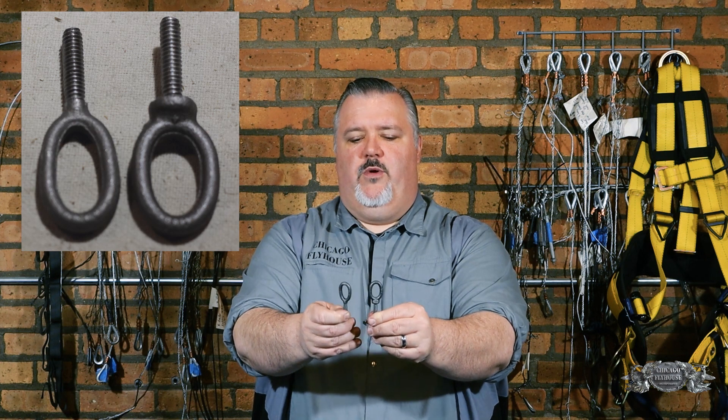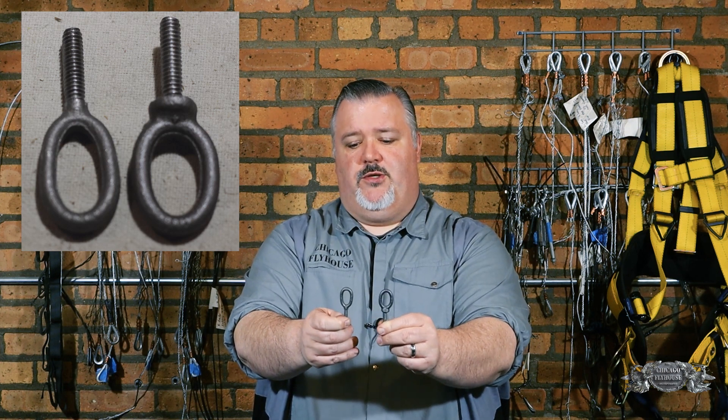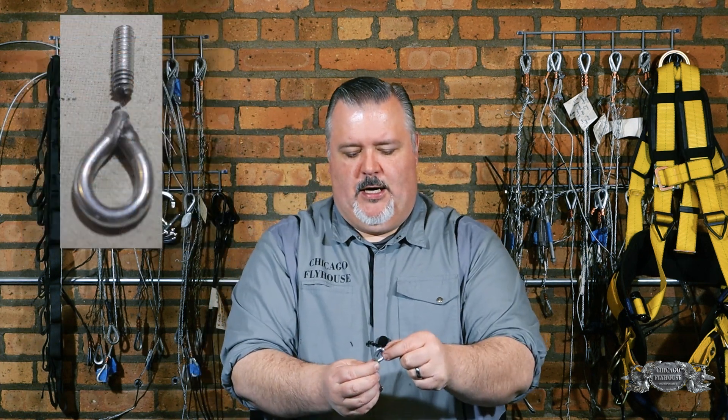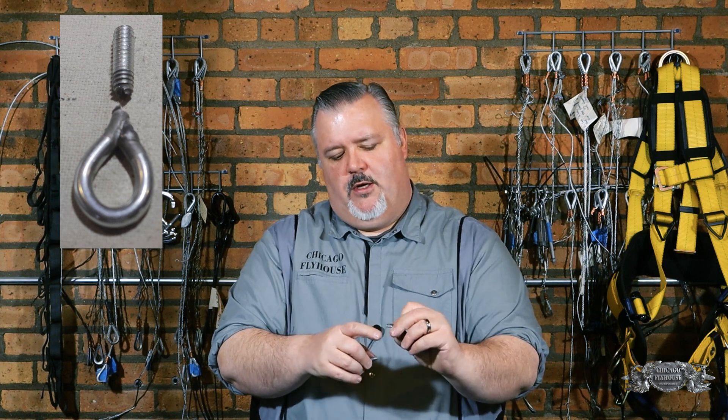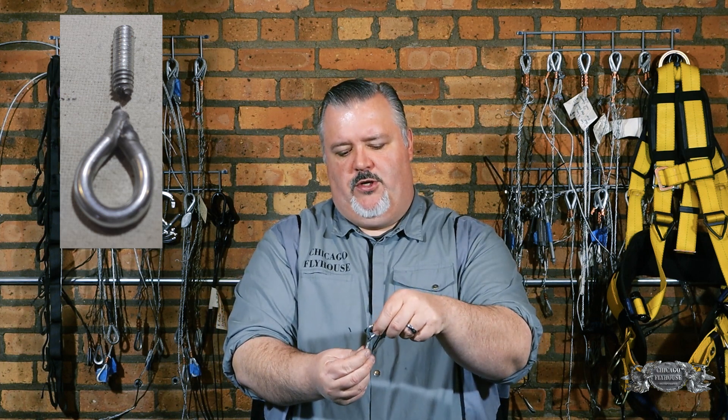Our straight down pull-out tests on the two forged pieces — we just got stretch. We got a good amount of force and they just stretched out; they didn't actually pull out or snap. Our welded eye snapped right off because the material, regardless of the weld, is not very strong. It snapped right where the heat of that weld changed the temper of the steel — not very much of a surprise.